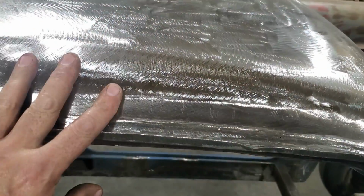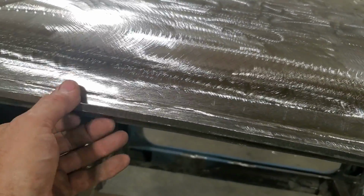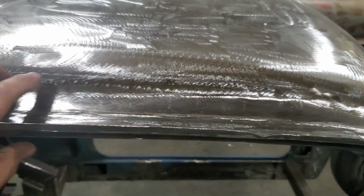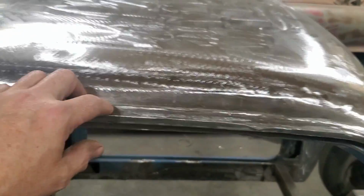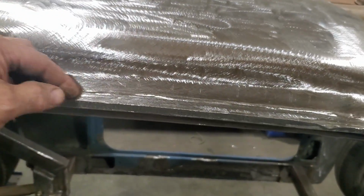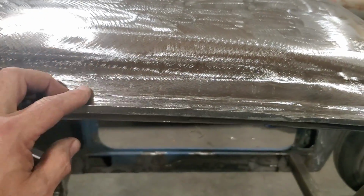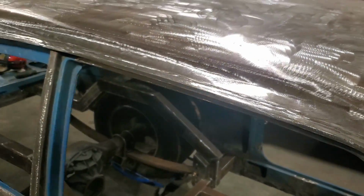Don't overthink it. I found it's a lot easier to make it in 100 pieces than to try to make it in 2, okay? If it takes you 100 pieces to weld it all together, that's a bit exaggerating it now, but my whole idea is it's a lot easier to weld 2 pieces of metal together to get a shape than it is to try to manipulate it to get it to go 3 or 4 different ways. That's a skill in itself and a timely manner.